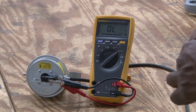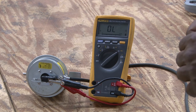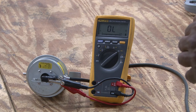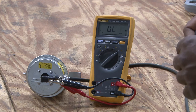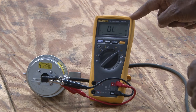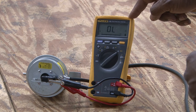This is an air flow switch found in many different furnaces as a safety device to make sure that the draft through the heat exchanger and the flue piping is correct. These are preset from the manufacturer to maintain a reading inside of the combustion chamber. This is a normally open pressure switch — we have it set for continuity on the meter, and once the pressure changes it will read a closed circuit.